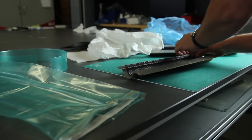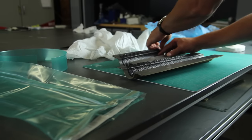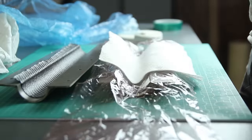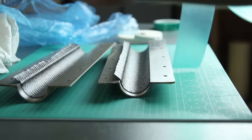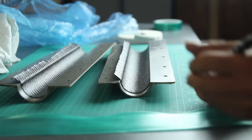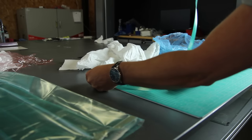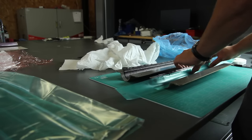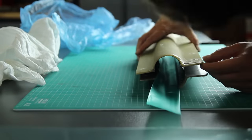After debulking, we remove all the films and lift up one edge of each mold half so it goes on the inside of the other half. I put a marking on the inner tubes so I know they're not twisted. When you have the film, sometimes it sticks together — you can inflate it by blowing on one end while holding the other closed.